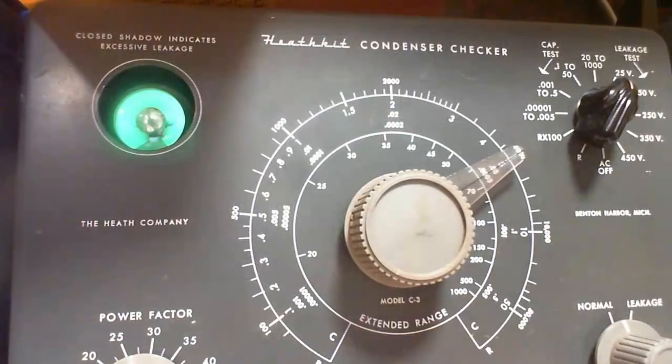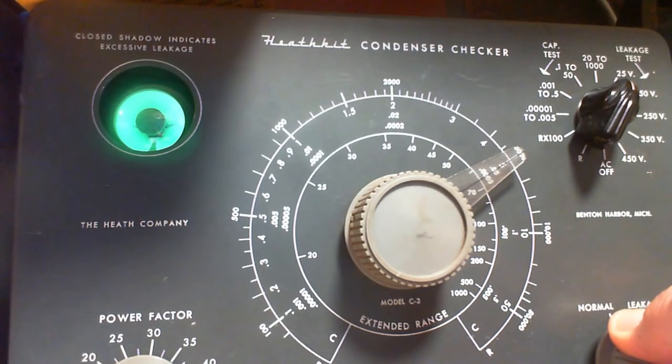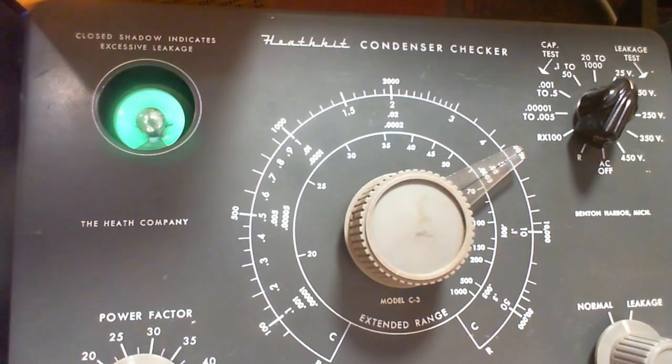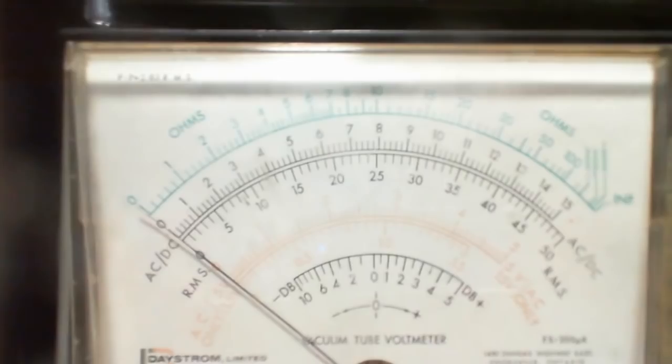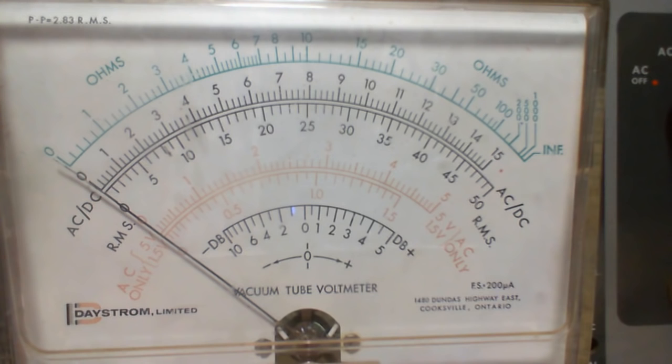Okay. Are we ready? Yeah, sure. 25 volts. Yeah, that's a bad guy. It's a bad guy, but the same as all the rest, though, really. I can't really claim that that one's terribly bad, and the others were so bad. Depends upon the duty of these capacitors, too. They can be leaky, but maybe not have any DC pushed across them, like this one. The tone control here may have no DC across it at all, so the leak would probably be quite unimportant.